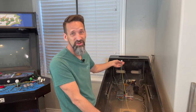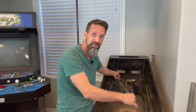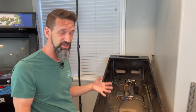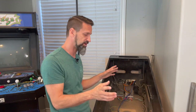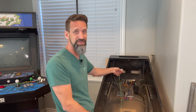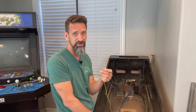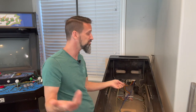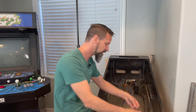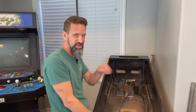The wires are going to get better — these are just basic wire setups right now, just enough to give me power for my flipper coils, slingshots, and a couple of wires running for switches to the flipper buttons. Obviously we're going to be adding a lot more wires. Once we have everything in its final location, we'll run wires at exactly the proper length, color-coded correctly, and build final wiring harnesses that look nice and slick. For now I'm all about quick connects so I can slide things on and off and rearrange things — we don't know exactly where the staircase or upper flipper is going to end up yet, so versatility matters more than a perfect connection right now.